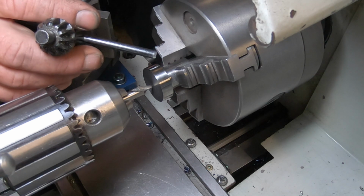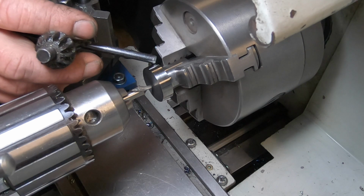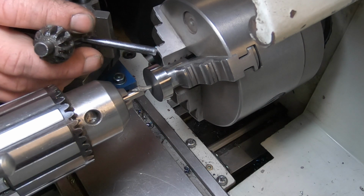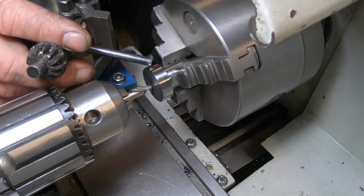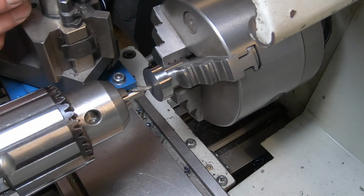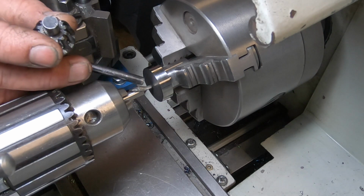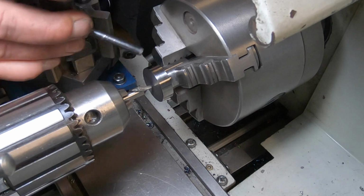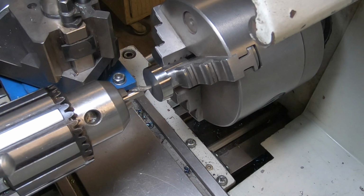And I've been through my high-speed steel little tub pile of stuff. And I found a little piece of high-speed steel that may be able to get up in the end and square the end off. The end has to be square, it can't be on a bevel, or a chamfered end, it's got to be square. So I guess we're just nutting out how I'm going to measure the depth precisely. Anyway, we'll get a center drill, that's a start.